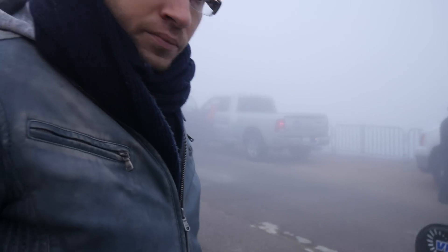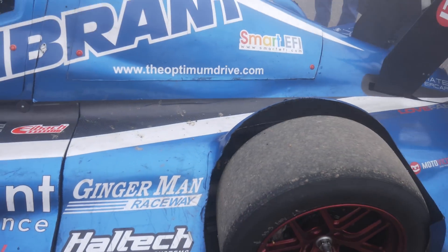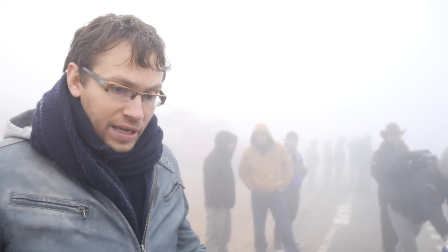I'd really like to talk about the rear end because it's one of the most interesting rear ends I've seen on a hillclimb car — specifically this whole exposed tire region. Whereas most cars of this body style tend to have either covered tires or fully exposed ones, can you talk through what's going on there? It's again linked to what I said about the general aero philosophy. It's a bit surprising because people are not used to seeing a front wheel covered and rear wheel open. Usually in F1 all wheels are uncovered and in Le Mans all are covered, but that's due to regulation. We tried to use the freedom offered by Pikes Peak to do what makes sense.